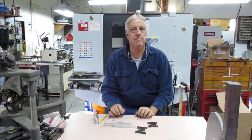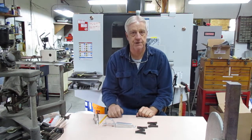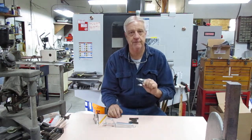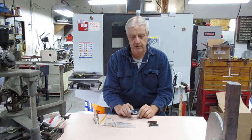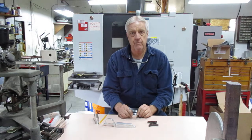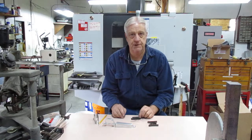When you're putting like a mid-length magazine box in a short action rifle and you need to transfer that pressure farther to the rear, a lot of times a factory spring will have too much drive going up, so you want to relieve it. Here at Wyatt's Outdoor, when we make these magazine springs, we actually make them a little bit stiffer than factory Remington springs. We do that on purpose.